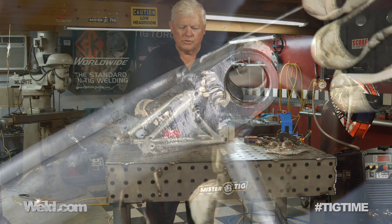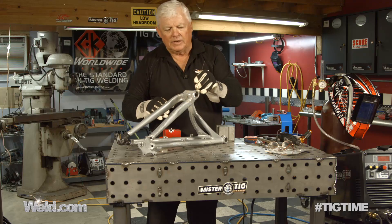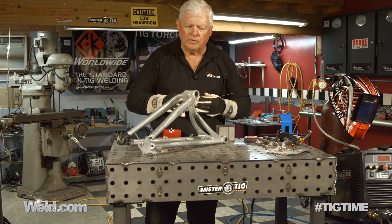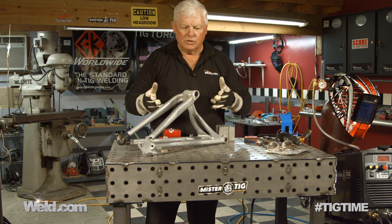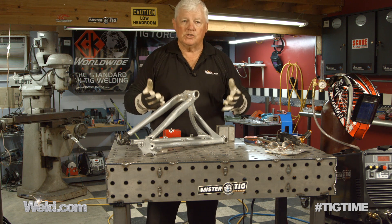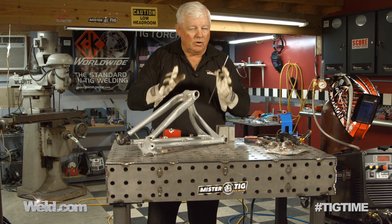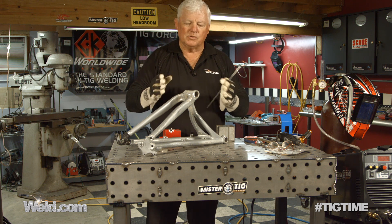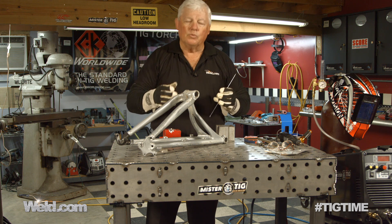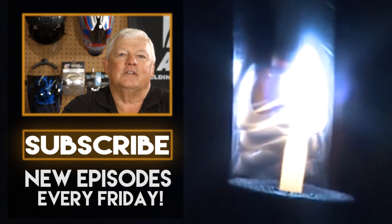You can see that I did wraparounds here, and of course this thing was cracked significantly on both sides — initially we looked at it and thought it was just one side. I used 5356 filler material and it seemed to work well. We're going to turn this back over to Paul — really appreciate you sending this to us. These are the types of projects that we're looking at. You'll notice that aluminum welds are always a little bit bigger than steel or stainless steel — usually two or three times the size — so it's almost impossible to get a little dinky weld. Thank you for watching TIG Time. I'm Mr. TIG. To stay up with the latest TIG welding technology and education, subscribe by clicking the button below.